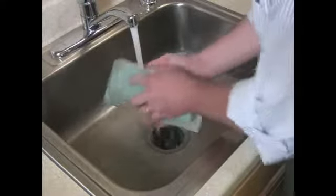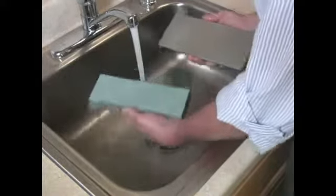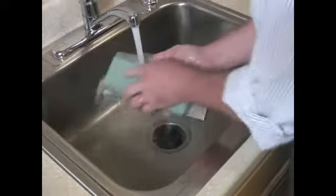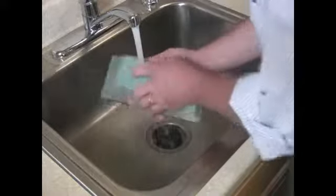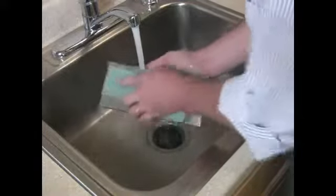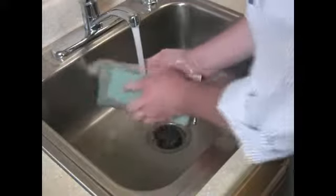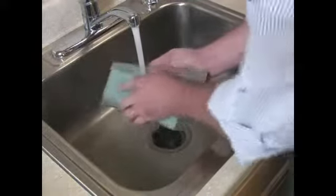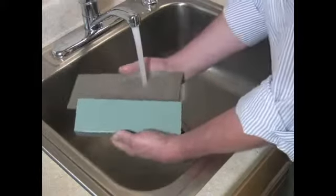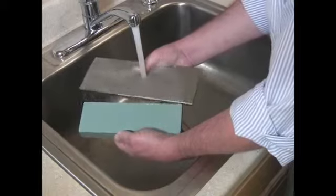You can see we're making some progress. You want to check it quickly to make sure you don't wear away more stone than necessary. We're almost there — keep checking the stone, we're just about flat. You can also tell by how the water stone wants to stick to the diamond plate. Just got one little pencil mark left — and that's it, we're back to precision flat, to better than five ten-thousandths of an inch with our DMT Diaflat lapping plate. Thanks for choosing DMT.